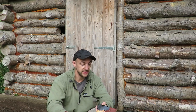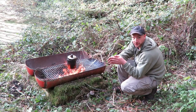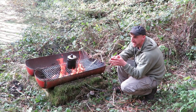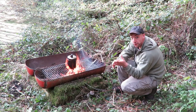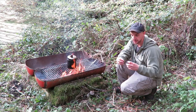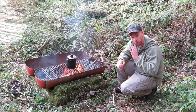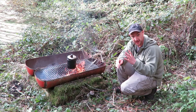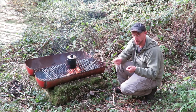I'm going to show you today how I sand this and oil it and bring it up to a standard I'm happy to use. I'm going to need some sandpaper, some boiling hot water, linseed oil, and maybe some wax. What we're going for is something they call gunstock finish. We're going to pour boiling hot water over the handle, the shaft, and all the grain is going to come out — it's going to rise up. We'll do that a couple of times, sand it off, and go down through the sandpapers from a coarse one to a finer sandpaper, and then eventually do something called boning.